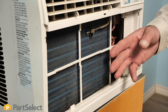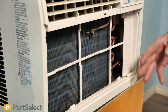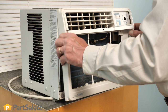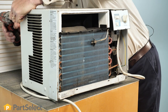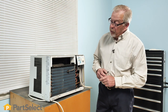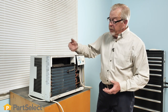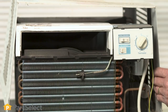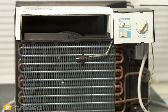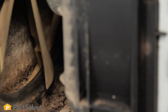If you don't have enough access to that complete evaporator coil, you may need to remove the complete front panel — it may be attached with either clips or grooves, or you may need to remove the outer cabinet first. With the rest of the front panel removed, we now have access to lift the cabinet off. We've removed the retaining screws for that and then simply lift that off. Now we have access to the condenser coil on the back as well as the fans.